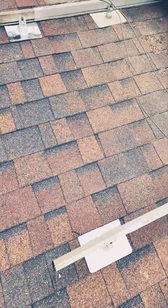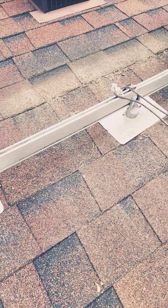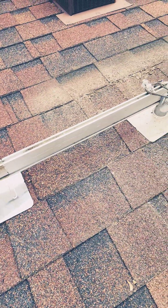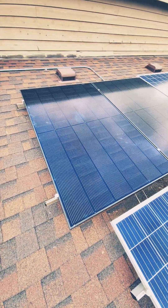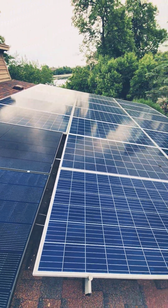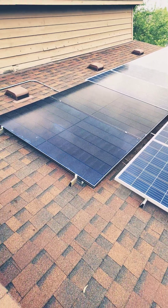We got flash feet in and 12-inch extensions added on to accommodate the module width. We had to do that because coming over more than two feet is definitely not appropriate for rails, and this one was even iffy where it was. And there we got the second module installed. 450 watts each versus 325 here — Canadian Solar replacement modules under warranty. And now y'all out there know what it takes to put dissimilar size modules — not just width and length, but height — into a long-term existing system.